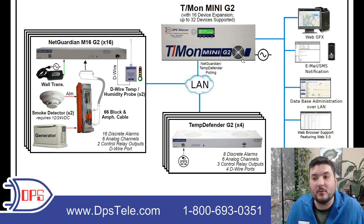The T-Mon has a couple of different ways to tell you what's going on. First — and I think the coolest interface — is the WebGFX view in the web interface. You set image backgrounds, which can be maps or diagrams of your network, any image you want, and then you put icons on top of it. In this case you can see a map where circles are going to start blinking red, yellow, or orange to tell you something's wrong. You click on the icons, drill down, and get a picture of what's going on at that site. You can even include a photograph of the site itself, so when somebody's going inside the hut to get into the racks of equipment, you can give them a picture before they leave the office — this is what you're going to look at, go to this rack, this device, you need to work here. It's very clear and a good tool to have.